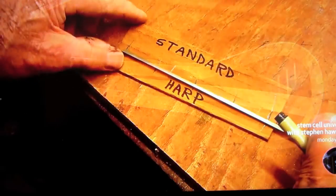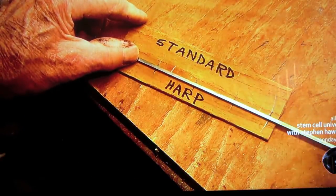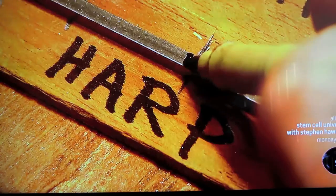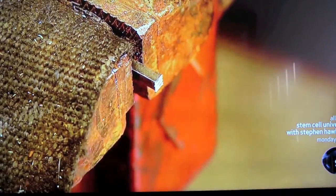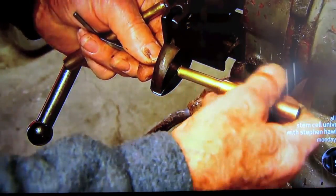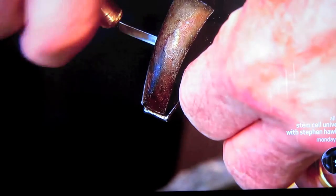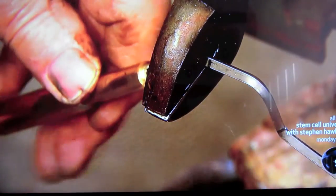This craftsman makes the jaw harp's frame out of a tenth of an inch thick square steel rod. He measures and marks the required length and bend points. He cuts the length with the standard hacksaw, clamps the rod in a vise, then slips metal pipes over the ends to prevent them from twisting as he bends them to form the arms of the frame.